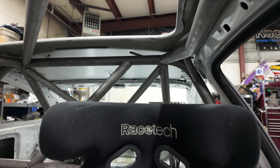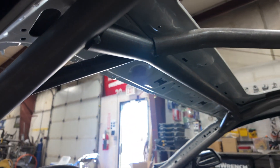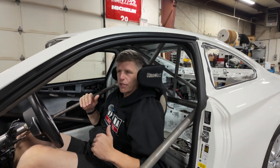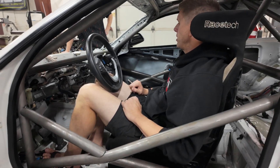If this seat rocks in a big side impact or you're flopping around a little bit, you've got to have clearance on your head. It's not good enough to sit in here with the rev one cage and say 'I think that's close enough — we can put some cage padding on that and it'll be okay.' It's not okay. So in rev two we've gotten rid of those factory sunroof cassette mounting points. It's a clean cut, it's easy to do, we'll have templates for that, and it doesn't damage the paint on the outside of the car. This whole cage is CAD-designed and made to follow the absolute tightest path it can on this car, while still being easily weldable — because if you slam it right up against the outside of the car you'd never be able to weld 360 degrees, and that doesn't do anybody any good. We designed it with both things in mind and it's a super tight fit.